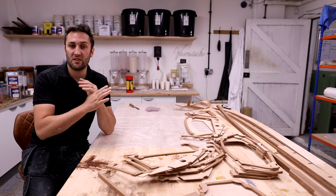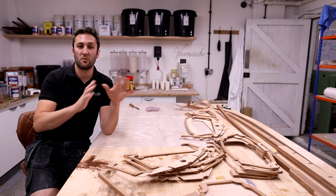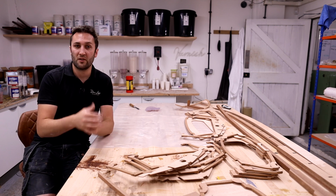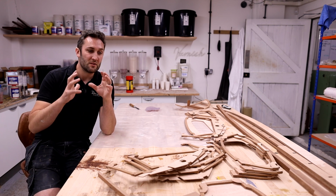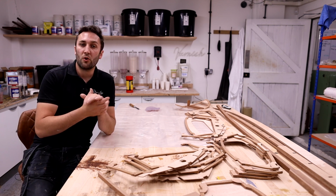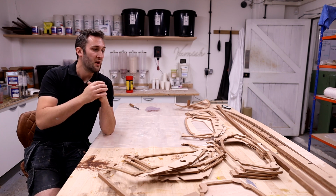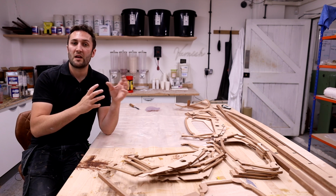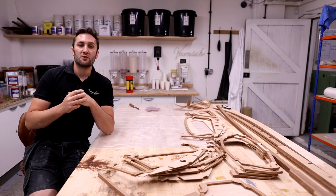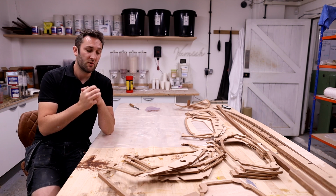So we don't want to be seeing any kind of expansion and contraction of timbers. We don't want to be seeing swelling of planks. This is definitely not a boat that is going to need to swell up in order to remain watertight. This is a complete modern wood composite construction boat. The whole hull is going to be cold molded. Any timber within the construction of the boat over a certain dimension is laminated. So dimensional stability is really at the core of everything that is designed into the process of building this boat.